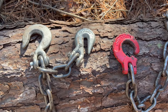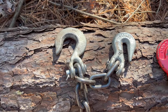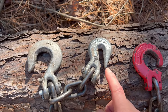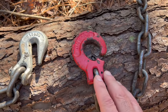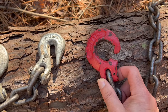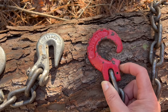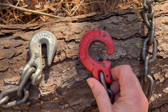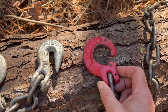I have some chain hooks laid out on the log. Over on the left are the typical chain hooks you're going to run into — this is known as a slip hook. This used to have a little flap on it to hold the chain in, but that's long since gone. Over here we have a grab hook, that's meant to hook onto a chain link and stay put. And then over on the right we have what's known as a choker hook. This has been around for well over 100 years and is the type that evolved to be appropriate for logging use. It's got the ability to slip so the chain can choke up on a log, and it has a fairly narrow opening with a C-hook shape to retain the chain if there's any slack.